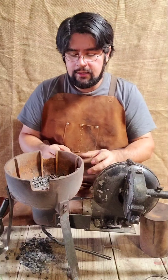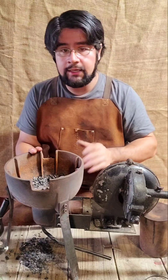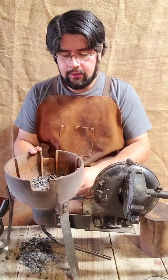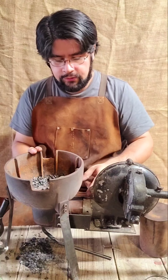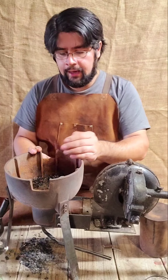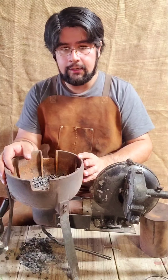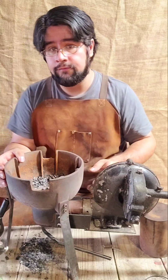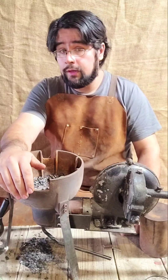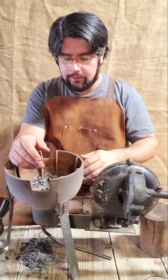The gapping is also an issue there. The little metal connector between the blower and the fire pot goes in a little further than it should and it's super thin — about a sixteenth of an inch — so that thing will burn out. I didn't even use it; I put an actual piece of pipe in instead and it worked a lot better. The original one also goes too far into the fire pot, so air only comes out of one section, creating a hot spot on one side instead of the center. My adapter cut it back so the airflow is more centered.